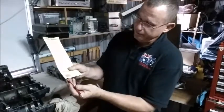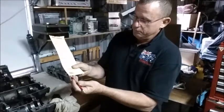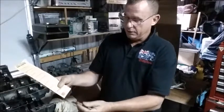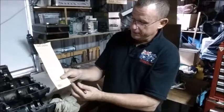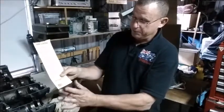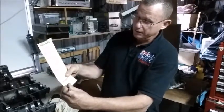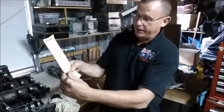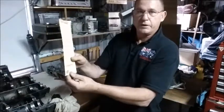But really, you can't have a 4mm edge there to put on your drill, because my pedestal base has a big hole in the middle of it. So I'll leave this hole base here and we'll come up, let's say, 20mm. That leaves us a nice big base to work on that we can put on our pedestal drill. Then we'll go the 4mm, and then up the 160. That will give us our 1.5 or whatever it is, degrees, and a nice big flat base that we can put on our pedestal drill.